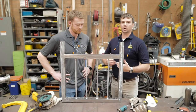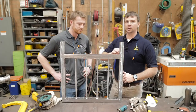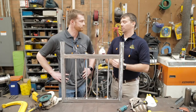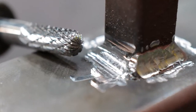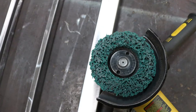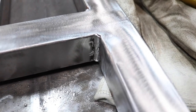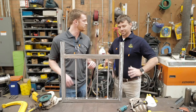The big takeaway from this video is how well the carbide burr did. Once all the paint was removed, you could see the carbide burr work looked really good — that's why we did the carbide burr first. The NCD 200 HD then came in and took out the paint. The carbide burr did an excellent job and was relatively fast. Two main takeaways: the time saved with that ceramic wheel and its increased aggression compared to industry standard, plus the finish it leaves. Being ceramic, you'd think it would leave a heavier scratch — it's not the case; it's in line with silicon carbide power wheels. So paint's gone, weld's gone, it's all polished up.